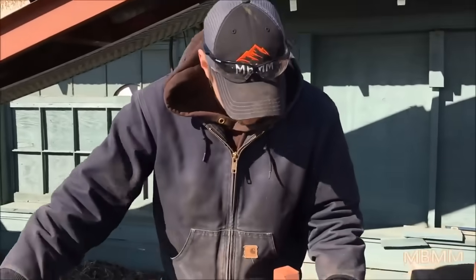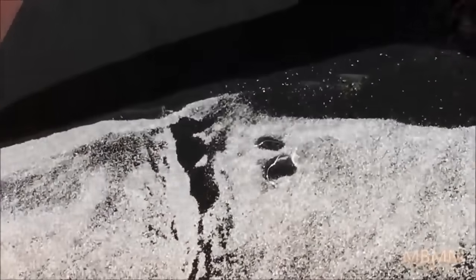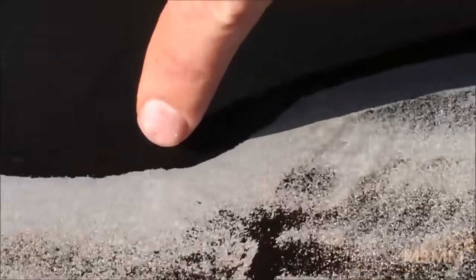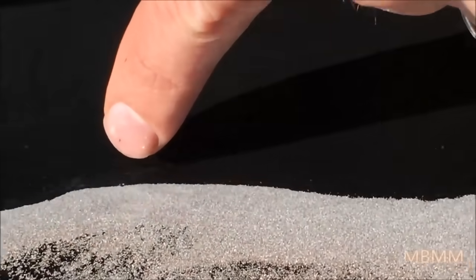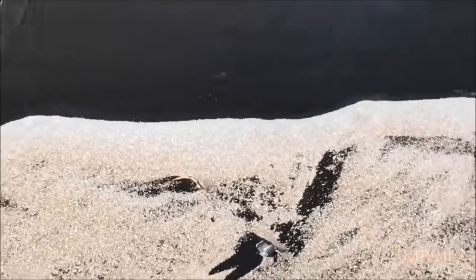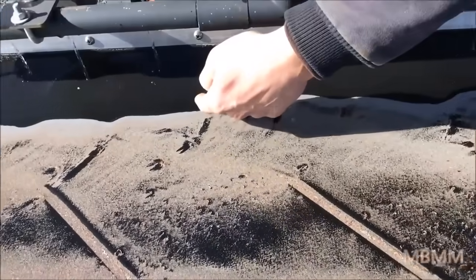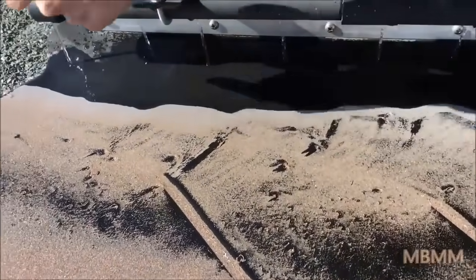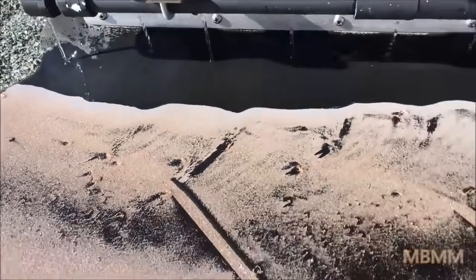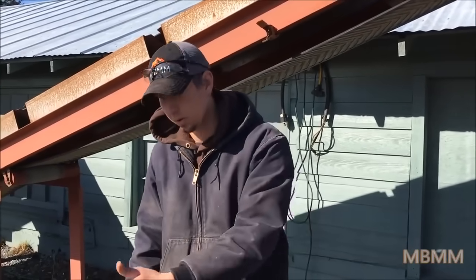We're just about finished running our second sample, and — I don't know if you can see it on camera — but right along the leading edge there are little tiny pieces of gold going all the way down into the number one port. That gray silver band is probably lead or tin solder, maybe silver solder, I'm not sure. But the gold is right at the leading edge because it's the most dense, working its way right down into the number one port. It'll be interesting to see what the assays are from these samples and whether we're recovering most of the gold in our number one port.